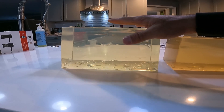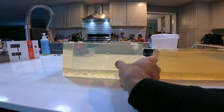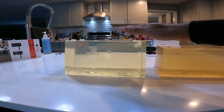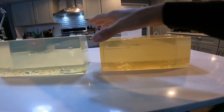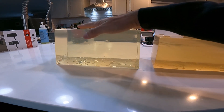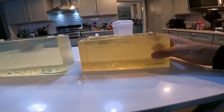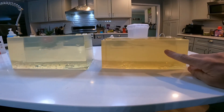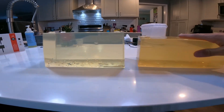I don't think this softer one is going to meet the standard for the FBI test, which uses 10% ballistic gel. The way you test it is with a BB gun — if the BB penetrates about three inches into the gelatin, that averages out as a good 10% ballistic gel. The firmer one feels like it might be pretty good; the softer one I'll need to tweak a little bit. We're going to shoot both of these with the BB gun and see how we do.